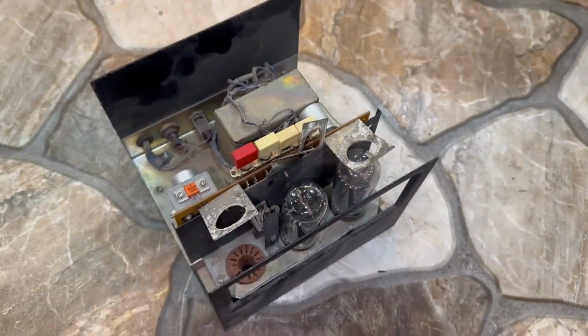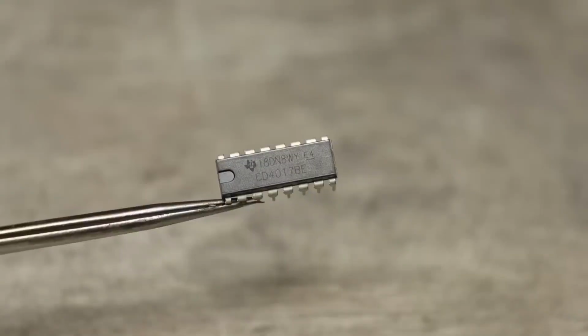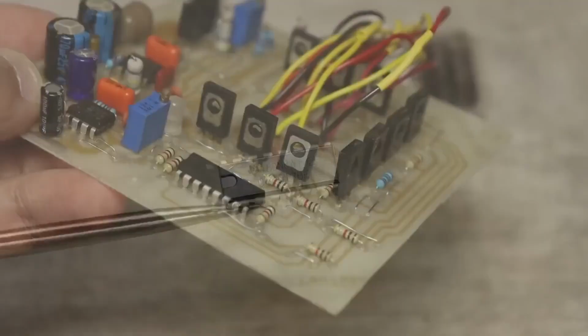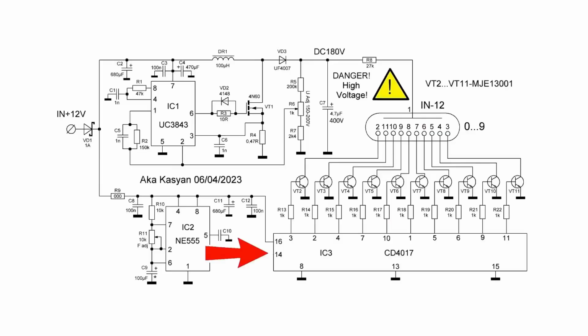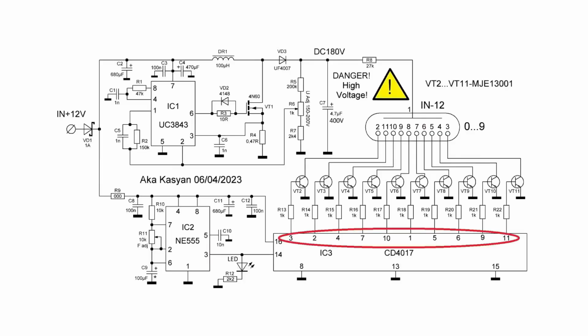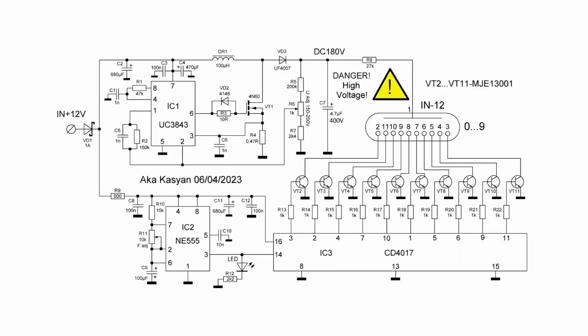One bulb is missing here. These switches, in turn, are controlled by a decimal counter decoder in the form of the CD4017 chip. It counts the number of pulses coming to its input and sequentially switches the outputs. That is, the one first appears on the first output, then on the second, and so on. Essentially, this one, or high level, unlocks the switches, and as a result, the numbers on our display change.